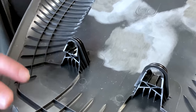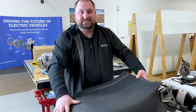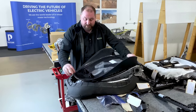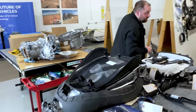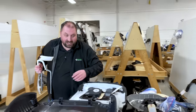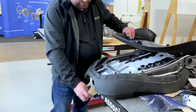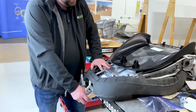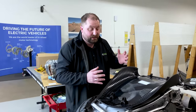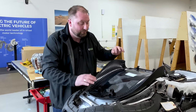That's helpful. So in the plant, they would hook onto the one side and then snap in onto the other. This does not do that. The upper attachment is actually the headrest. The components in the pipes of the headrest, there's a plastic component as well, actually enter through the seat and lock into the seat back panel. All right, what does that mean? It means you don't have to purchase additional fasteners. So purchasing in the assembly plant, they're quite happy with that. I don't have to buy those components.